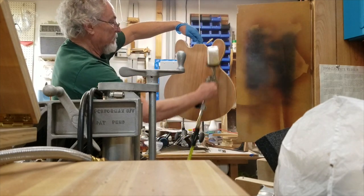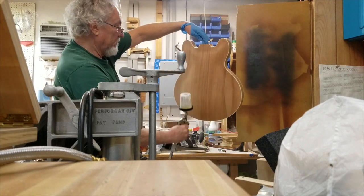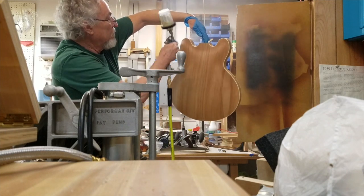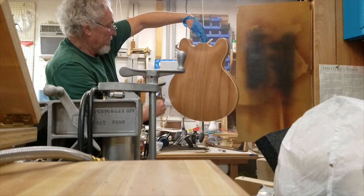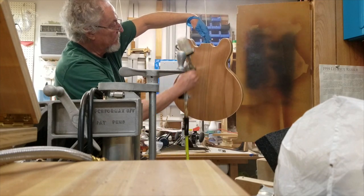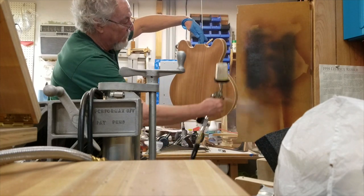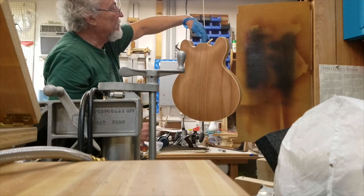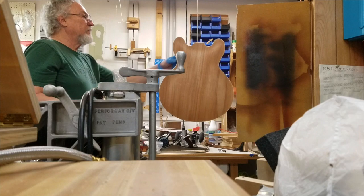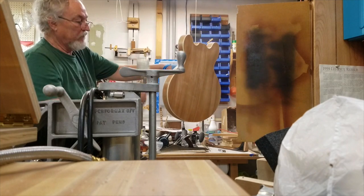Asking my dad about it later, he just said that he got really excited about doing the initial coats on it and jumped into it, not thinking, and didn't even realize he hadn't put on a respirator. So obviously a mistake, but we did 8, 10, 12 coats of lacquer on here, and every other subsequent lacquer finishing was done wearing a respirator, even in the same ventilation booth. So make sure you guys are wearing your respirator, just for safety caution.